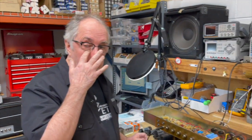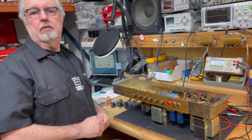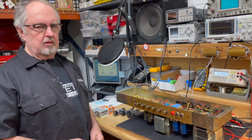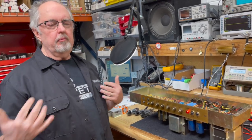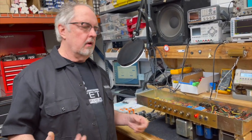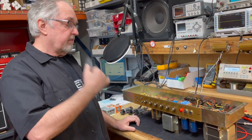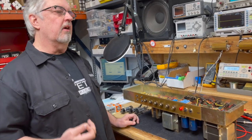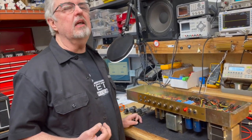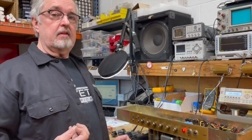All right, enough noise. Okay, so basically what we did was just figure out how to hack an amp to get it to behave the way you want it to, and the different kinds of hacks and their drawbacks and their advantages. To me, this particular amp, set up with 6CA7s and variac down, almost starts to sound a little squawky and fizzy, and I would want a little bit more of a robust sound.